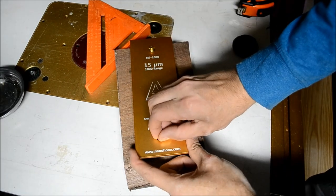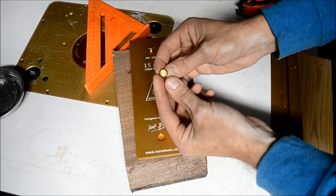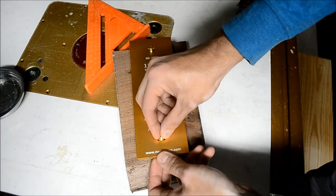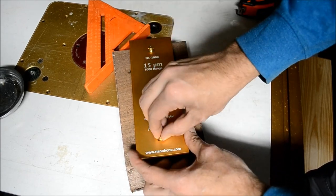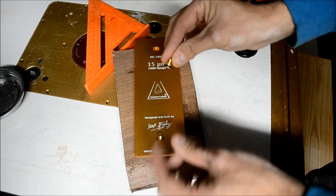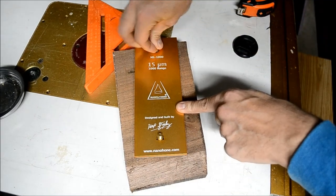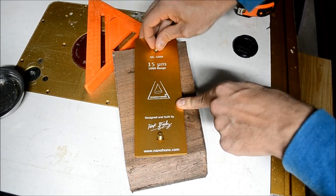So I've filed these down enough so that the O-ring sits deep enough so that it sits really tight in there. So it takes some effort to pull it out, which is fine. I can always make it smaller if need be. But it'll sit in there pretty darn tight. So even that one might need to be a little bit smaller.